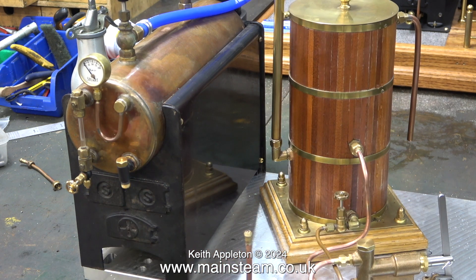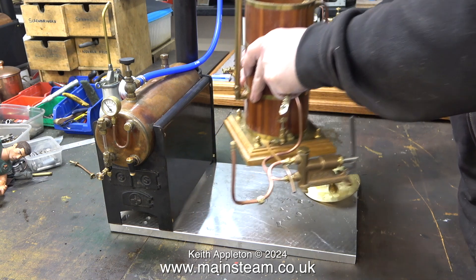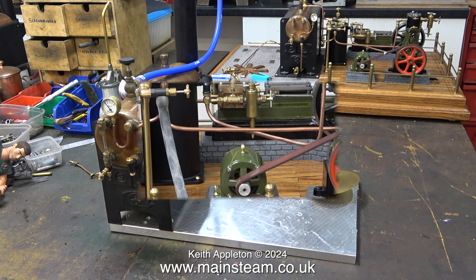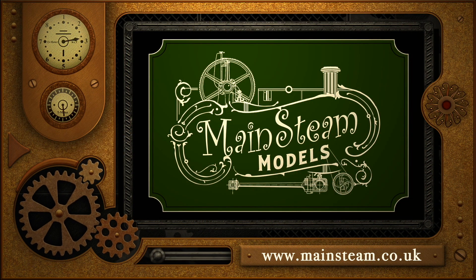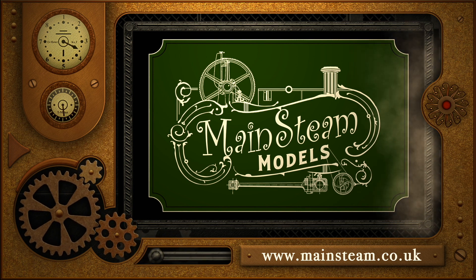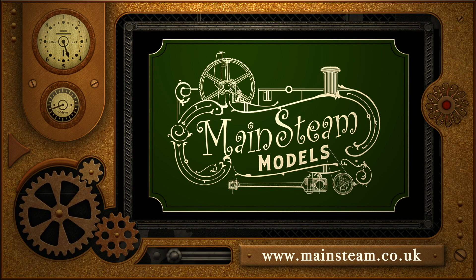So you can now lift that — keep it level, because it's full of water. I put my Action Man away, and Andrew left his laying on the bench. Here he's taking the water tank condenser economiser unit and putting it in his car. To finish, I'm changing the subject radically. My experiments with leather belts for driving dynamos on steam plants is still underway, and in my opinion I have found the best solution so far — a thicker belt with three staples in to hold it together, and it looks the part and it works. All that remains is to say: stay safe, stay healthy, thanks for watching, and I hope you found it useful. Please take the time to visit my Mainsteam Models website and click on the Video Playlists section, where you can find other videos and watch them back to back.